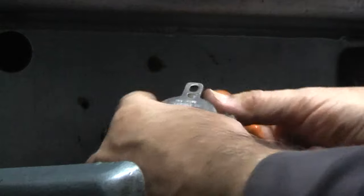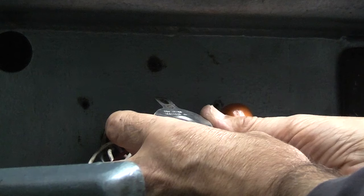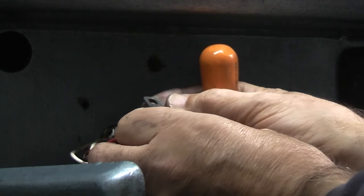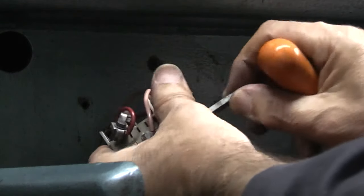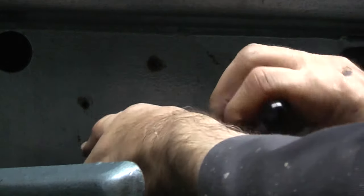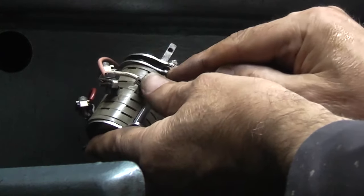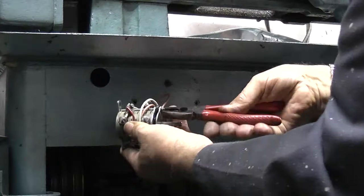Now the make of this switch is Santon, England, 16 amp, 380 volt. It's got L73 at the bottom, and at the top it has SBV137KA. So what I think's wrong with this, if you turn that, there's no resistance there to anything. So it might be this spring that's gone. I can undo this top nut here and it'll just take the plate off with the springs. If I undo the second nut, all these sections will come out.